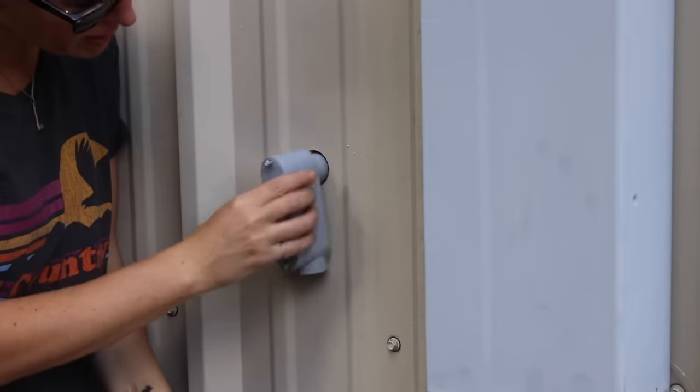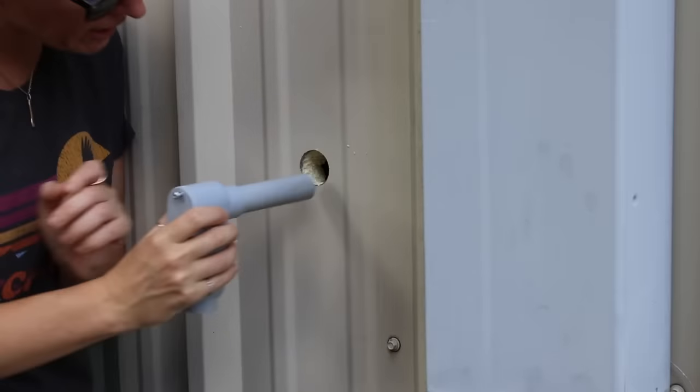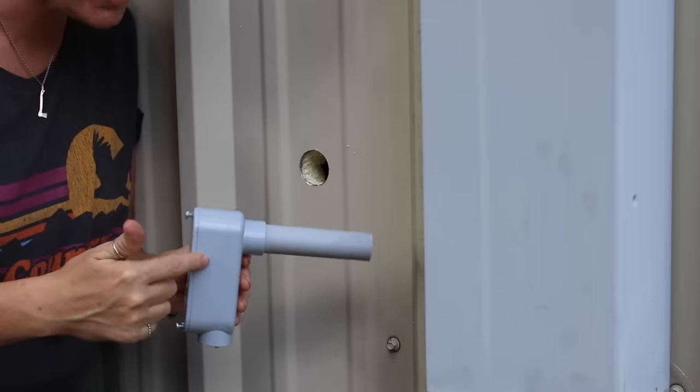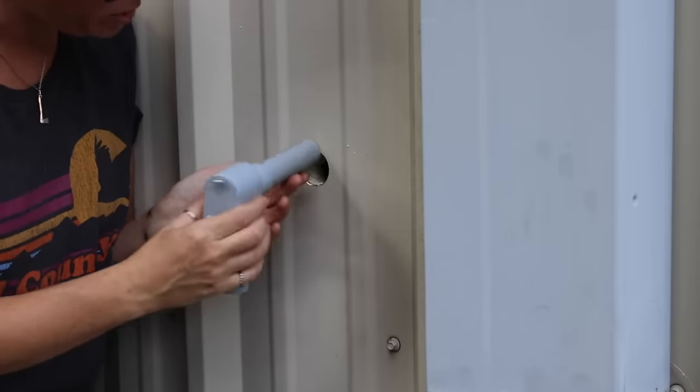To get to the inside, this piece is not even all the way through the wall, so you can just cut a piece of conduit in order to get you all the way through. Know that they do make a different cement for electrical conduit instead of the regular PVC one that you're probably used to.